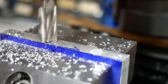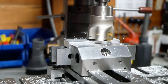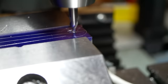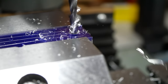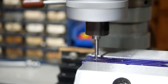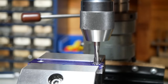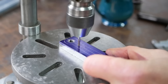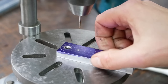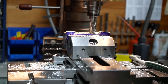Let's have a look at how we made the prototype pressure gauge for the Helix machine, starting with the handle. The version you saw earlier in the video was CNC machined, but manual machining is a really good prototyping technique. This method allows us to try lots of design options without investing in expensive CNC machining, so the pre-production prototype you saw earlier is actually the result of several earlier prototypes. Once the rectangular block has been shaped for the handle, the holes are machined and the fixing points are tapped in. The rectangular shape allows us to accurately reference the position of the holes.